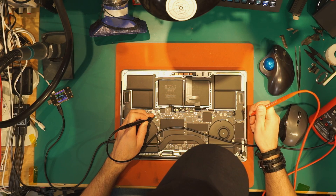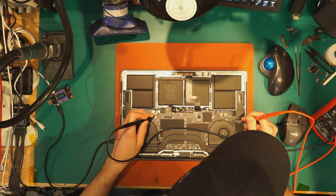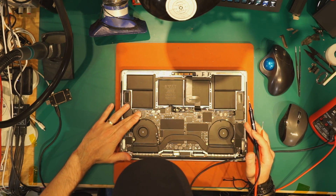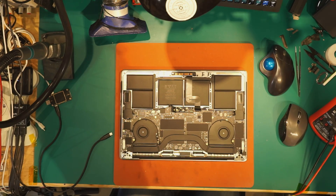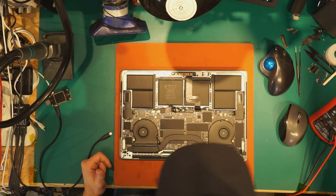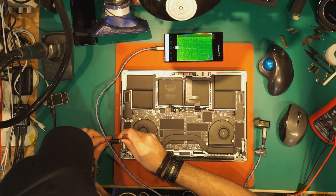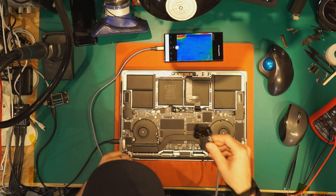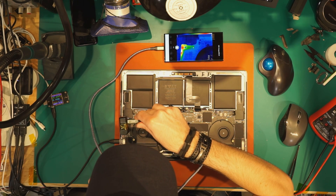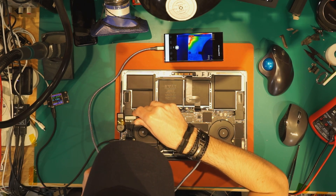The SSD is 2.5 — it's OK. Voltages from Ocarina: 1.8 is OK. Wait — something gets hot here. Let's... actually, it burnt my finger. I have to take my thermal camera. OK, so let's check what gets hot. Yeah, it's something on the other side of the SSD. I hope it's not the SSD.